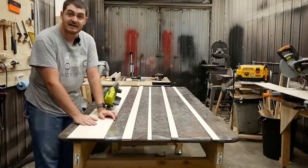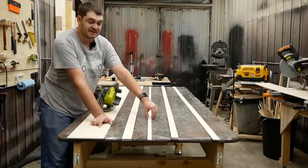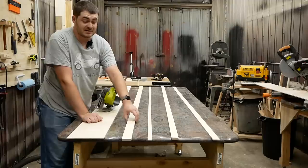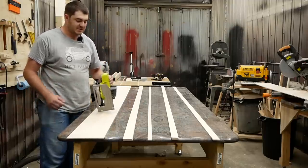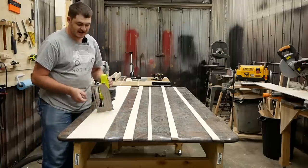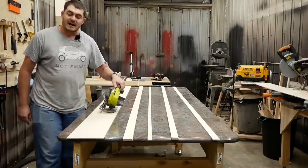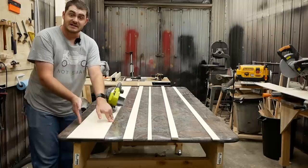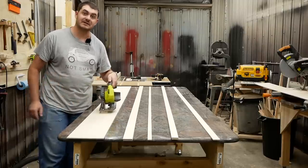The base of my track I cut to eight inches wide because I need about two inches for the dovetail clamping rail, two inches for the guide rail, and the remaining four inches is the distance between the edge of my saw base and the saw blade itself. It's actually slightly less than four inches, but I need to cut this part a little bit oversized because we're going to cut the edge off with the saw itself later on to make a zero clearance track.